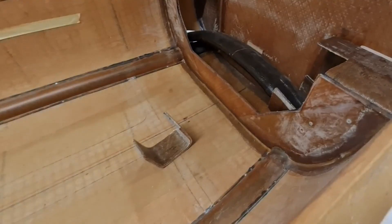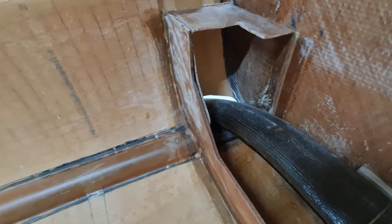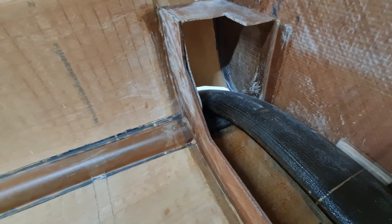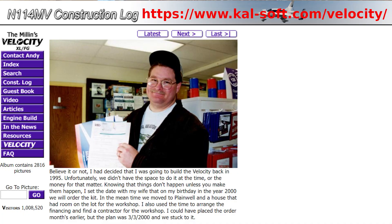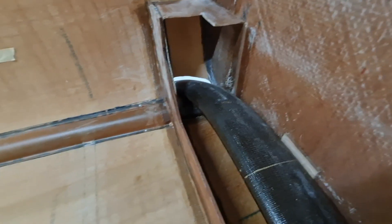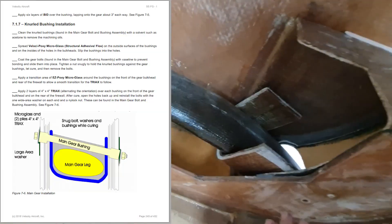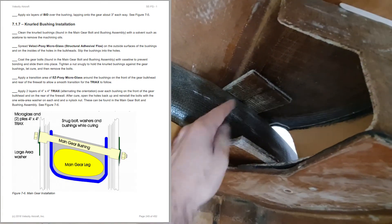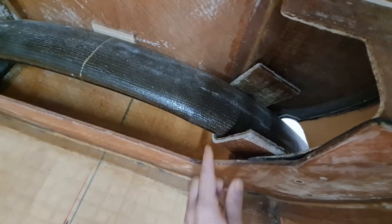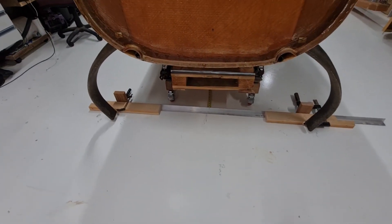That went to custard as soon as I realized that the middle of the gear leg is much wider than the outer bits, so at least on one side you're going to have to make your hole a lot bigger than the other side. I was reading another builder's weblog and he notes that these holes actually need to be a lot bigger than the gear legs anyway. What happens is when the gear gets supported there's a big bolt that passes through this hole here and out the back of the firewall, so that bolt sits over the top of the gear leg — that's actually the fixed point. The whole gear leg is designed to expand to take the loads of landing.